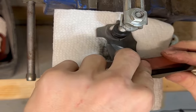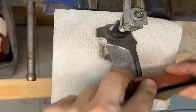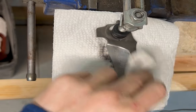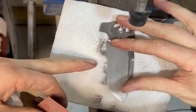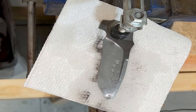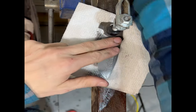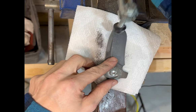If I just wanted a straight contrast without too much depth I'd use muriatic acid — they just etch differently, and you figure that out by doing it a bunch of times. What we'll do is sand it and then go back and etch it another cycle. We're using 2000-grit sandpaper, so it's really only taking the top off, and as we do this multiple times it'll start to get some depth and contrast and give it a really cool look that I think will go well with the mammoth tooth. I'll spare you the whole cycle and we'll go through that off camera.